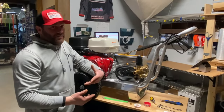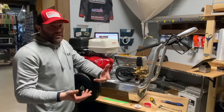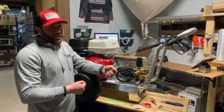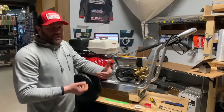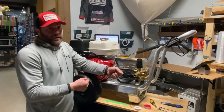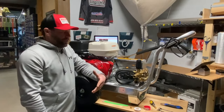What that does is that water is just going to heat up really quickly. This is why you hear companies or homeowners telling you that you constantly have to be on the gun and you don't want to let your pressure washer sit for too long. So if you're out pressure washing and a customer comes up to talk, you feel like you've got to run back to your pressure washer to quickly release the pressure so you don't ruin your pump.